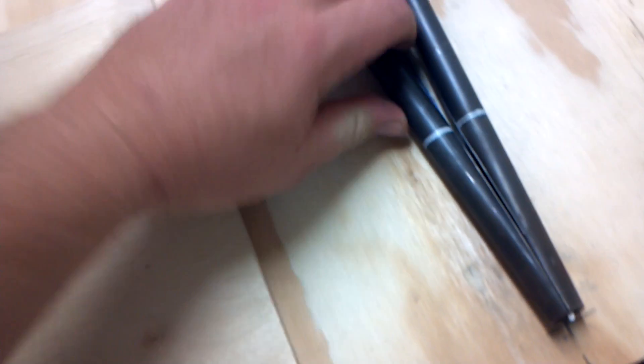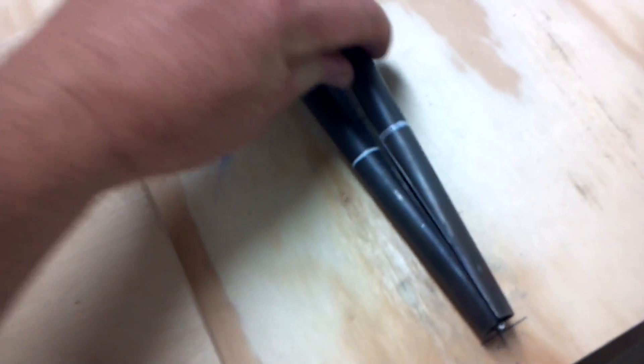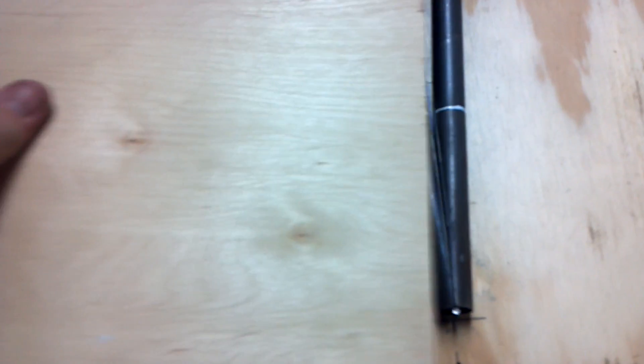So this one I cut, just set it to the side. I take the next one, shove it in, and go to the nail. But instead of putting the board on this side, I flip it. Remember, a nail is about a strong sixteenth thick, and you want a dead space between the pipe — you don't want metal-to-metal touching when you weld it. So you go nail-to-nail on this side, draw a line.